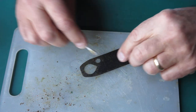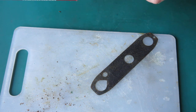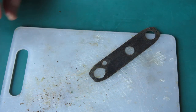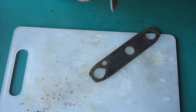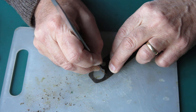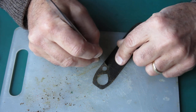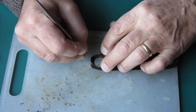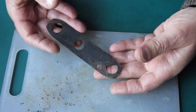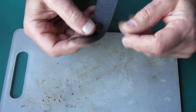The object of cleaning the leatherettes is twofold: it's to get a good surface that'll actually take adhesive and stick well and reliably, and it's also to get all the lumps and bumps off so that when the leatherette goes back on it lies nice and flat. Although the appearance of the leatherettes doesn't have much bearing on the function of the camera, it does have a big bearing on the appearance. If you're doing an overhaul, it should look like it's been overhauled — the appearance should be improved. There's certainly more adhesive at this end, which may mean that piece of leatherette has been up and glued back more times. That's nice and clean under there now.